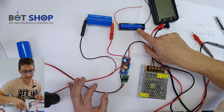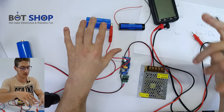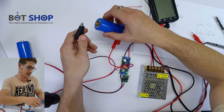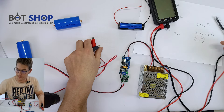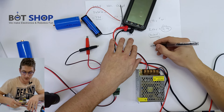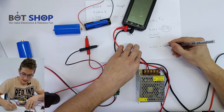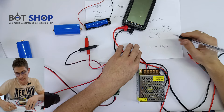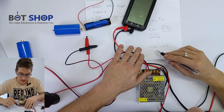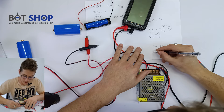When setting the voltage of the board, don't do it while your batteries are connected as you'll get an inaccurate reading. Remove one side of the battery, take a voltage reading, and set your voltage to the calculated 4.4 volts. Make sure you're turning the right knob. Now you're going to be left with a fully charged battery — you've taken into account the voltage drop over the diode, which means this should charge to around 3.65 volts.